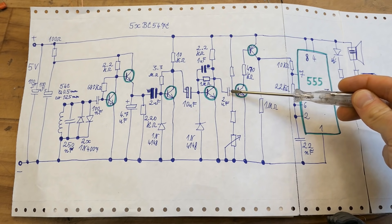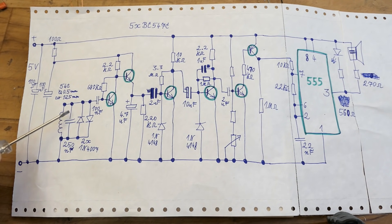This potentiometer shifts the threshold up or down. You have to choose the capacitor for the resonant frequency to match the transmitter. Somebody in the comments suggested using a variable capacitor, but variable capacitors usually go to only about 500 picofarads, and the capacitance needed here is almost three orders of magnitude higher. So I ended up using 250 nanofarads — I started with 220 nano and added 10 nanofarad capacitors in parallel. When adding another 10 nano caused the amplitude to go up, I knew I needed more than 220 nano. I kept adding until the amplitude went back down, then went back one capacitor.